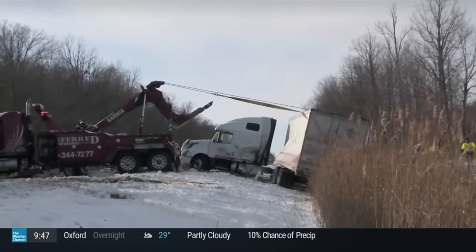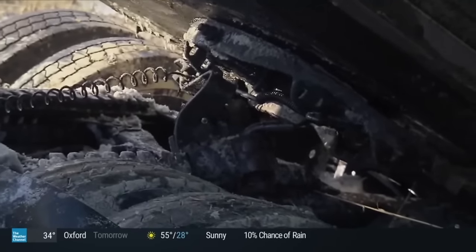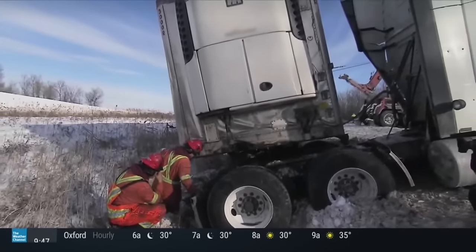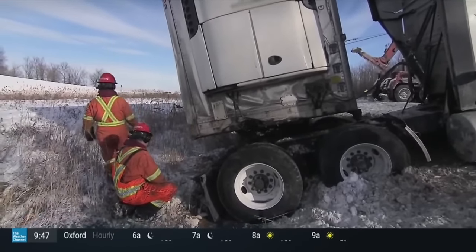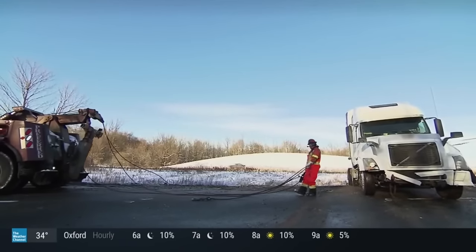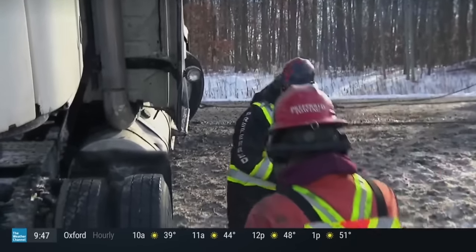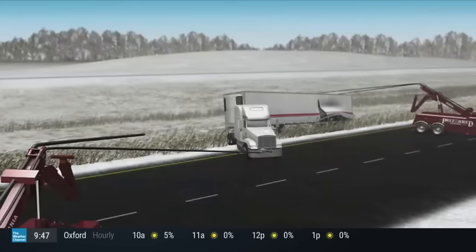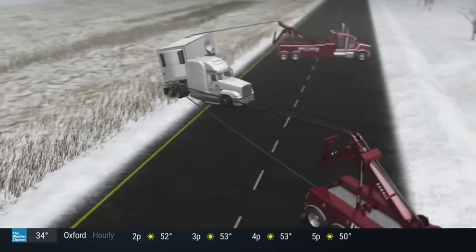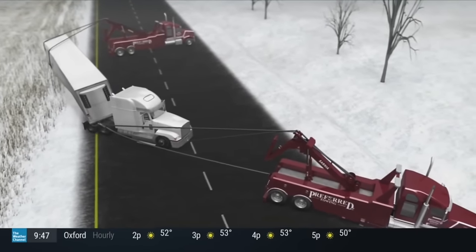Okay. They need to ease tractor and trailer to the road as a single unit. But with the fifth wheel sheared off, there's nothing connecting them. Now we've got a floating trailer on top of the tractor. One wrong pull, if we go too far one way or another, this trailer is actually going to slide right off the back of this tractor, probably roll back down in the ditch and go over it. So Kyle will run a line to the tractor and double another line to the trailer, holding the units together all the way up to the highway.